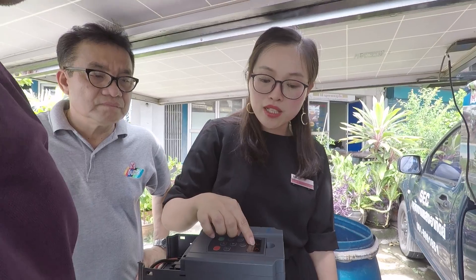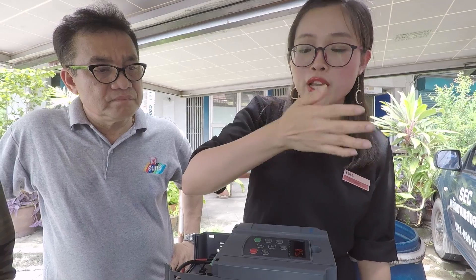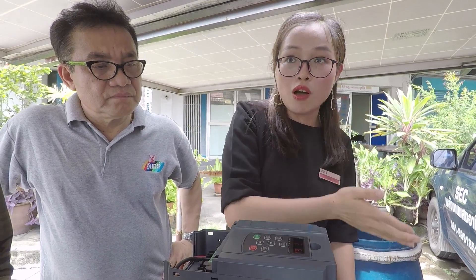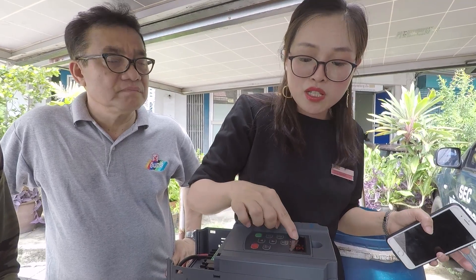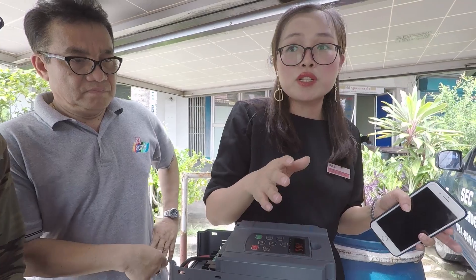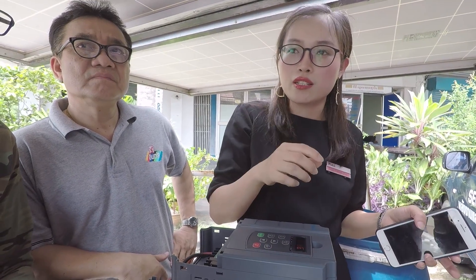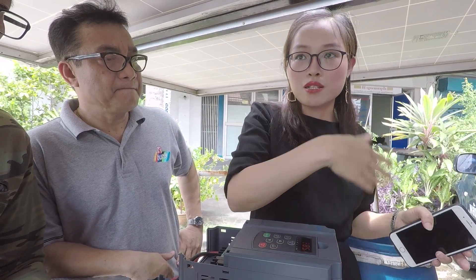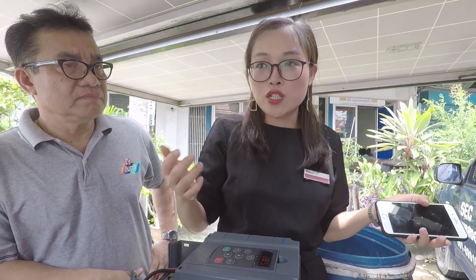This is the MPPT voltage — it will always be 285 volts, according to our rated voltage. If it is more cloudy, the frequency the inverter outputs will drop further, but it will keep the pump still working — it will not stop. The MPPT (Maximum Power Point Tracking) keeps the system working until there is no input voltage at all, then it stops.